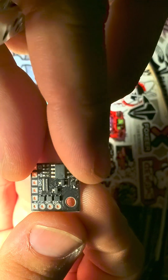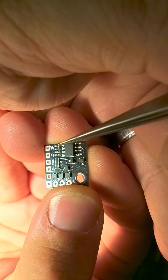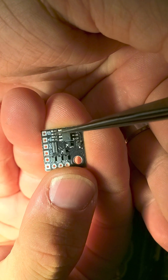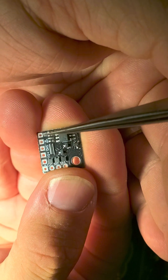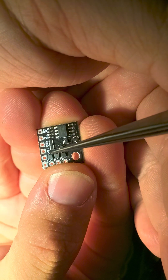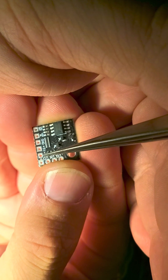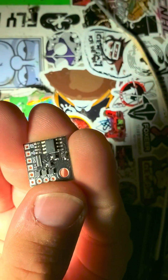On this edge, this is where you're going to deal with power and signals. You've got LED in, LED out, and then LED in. Your LED pad on your flight controller is going to come right here to LED in. And then if you were to daisy chain a second chip, it would come out from here and into the next, so that you can have up to 32 of these connected to Betaflight. Ground here and five volts here — ground is going to go to any ground on your drone, and five volts just to power the addressable chip. The next pad over is VBAT, so that's going to take full battery voltage into here and feed it right back out this positive. And then there's your negatives for the actual LEDs.